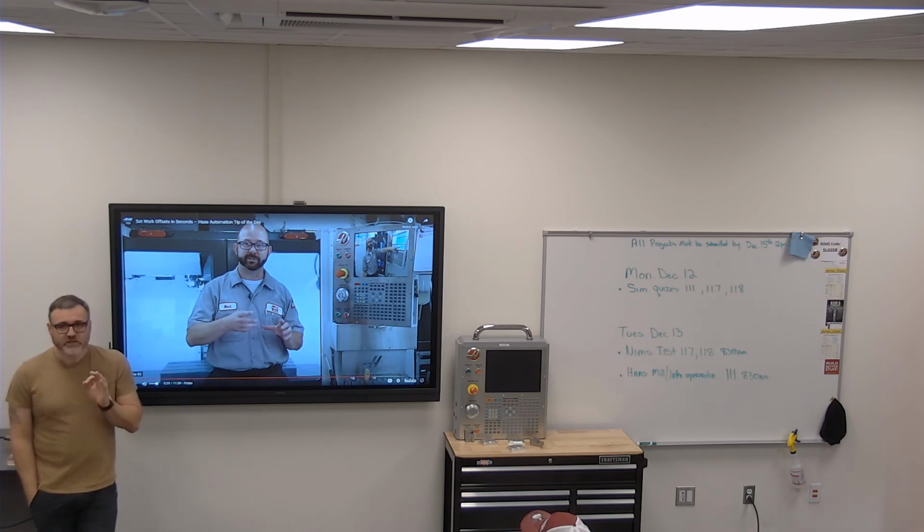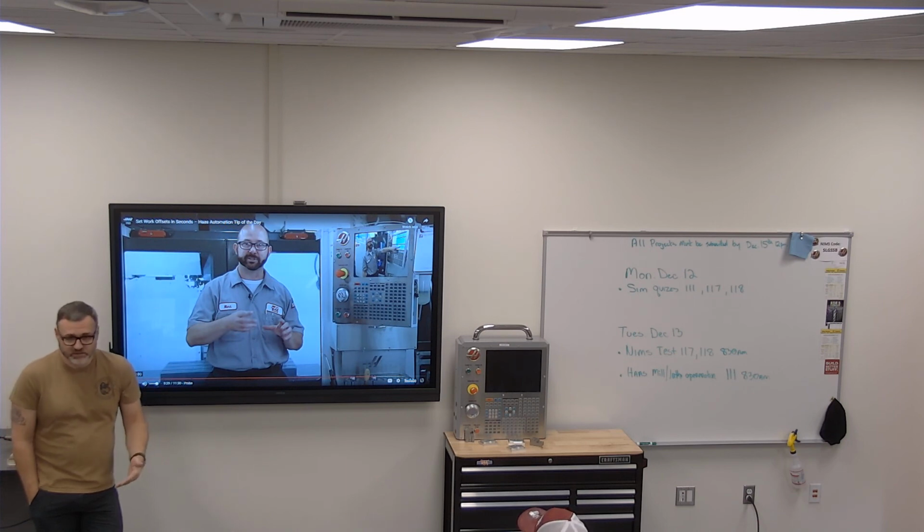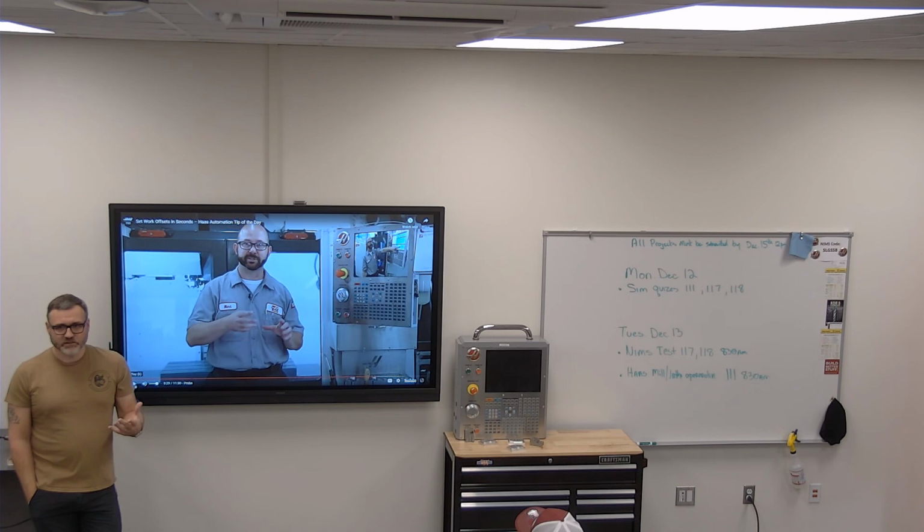Now, occasionally, you will get into a probing cycle and it gets stuck. It won't come out of the probing cycle, and you'll try to go up and down and over, and you're like, man, it just won't go. If you hit End and then arrow left, it will knock it out of the cycle. But every semester, somebody gets stuck in that cycle, and they're like, I can't remember what to do. End, arrow to the left, it'll knock you out of the cycle. It's got to be a wrong button sequence that people mistakenly do to make it happen, and I'm not sure what the sequence is. I've done it myself where I'm like, I'm not sure what to do here. But End and then arrow to the left will get you out of that cycle.